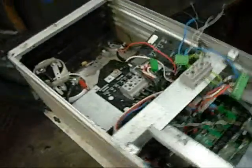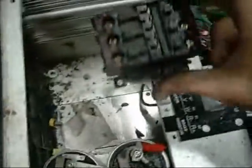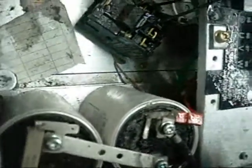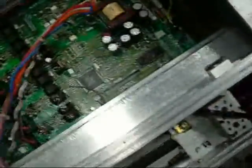We'll pull the covers off and just see what's inside. This big one is very much the same, just larger. It's been raining outside so it's soaking wet at the moment, but it's all there apart from the digital board. That's AC in, and there's the mains contactor. That cap's had something dropped on it - smashed the discharge resistor, so that one's no good. But that one is okay - there's a 2200 microfarad 385 volt DC cap, pretty serious stuff. It's all trash really; the CTs maybe I'll keep if they're not water-affected, and if I can get the control board out and see what's underneath it.